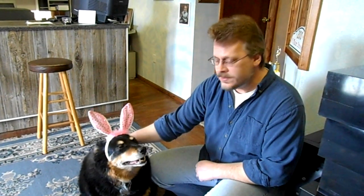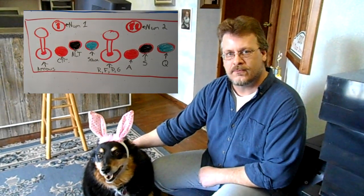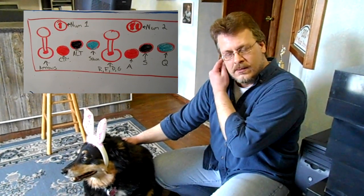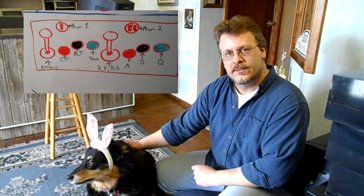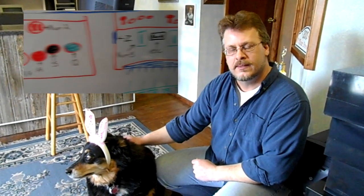Today we're going to be working on a new solution for our Raspberry Pi arcade system. Since we're putting it into two-player mode, there's not enough GPIO pins to satisfy the 21 positions we need for all the flippers, coin returns, and everything. There are only about 18 GPIO pins available, but we know we're going to need at least 21.